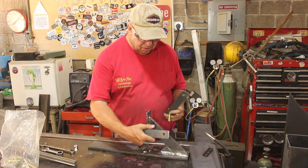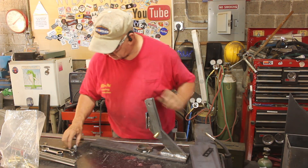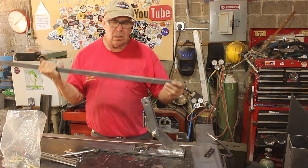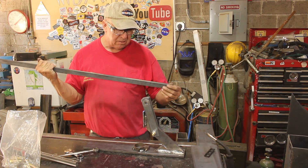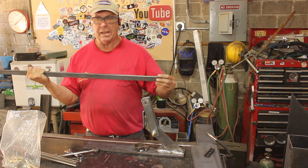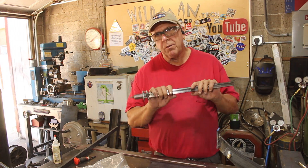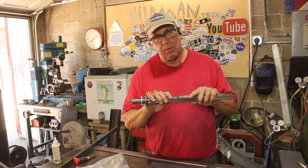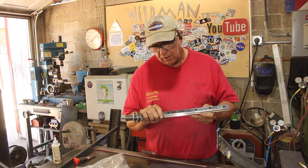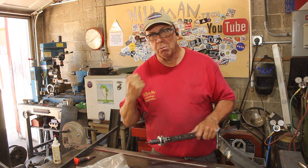Off-camera I made these linkage bars and drilled the hole in the tower. This half-inch by one-inch solid steel bar should be tough enough to withstand the forces this thing is going to generate. We'll start by drilling a hole in the end of it, mount it up, and see what kind of range we get — determine how long or short it needs to be. I measured the travel and it turns out we need one inch of travel, which makes this rod too long. I took it to the bandsaw, but this is some hard stuff so I'm going to chop it off with the abrasive cutting wheel, then put it back together.